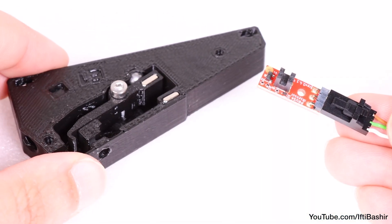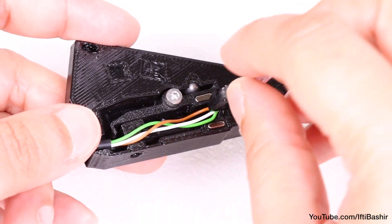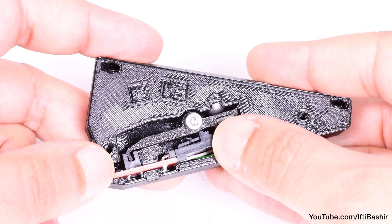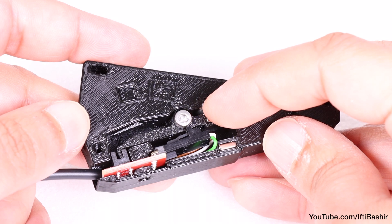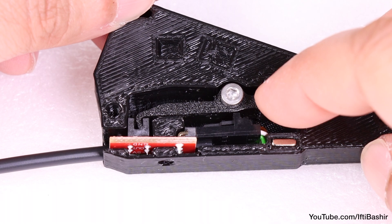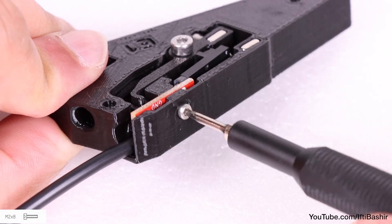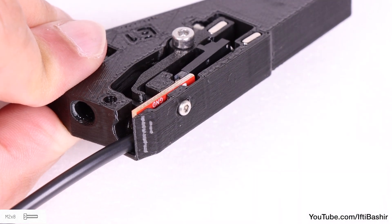Install the sensor into the housing assembly by inserting the cable into the groove first, far enough so the plastic connector is approximately in the middle of the sensor base, then fold it back on itself while pushing down into the dedicated groove on top of the previously inserted cables. Ensure the lever fits into the sensor and can move freely without obstruction by any cables, then secure the sensor with a single M2x8 screw going in from the bottom — no need to over-tighten, just until snug.